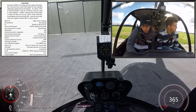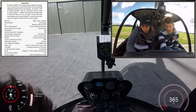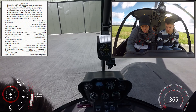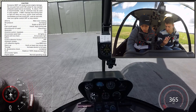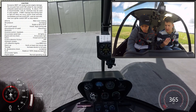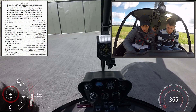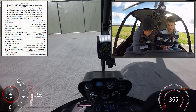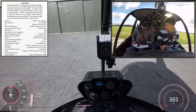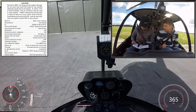It's looking like it's going to start — we've got 40 seconds. Once it reaches 60%, that's self-sustaining, so you can take your hand off the fuel and put the guard on it. And that's it — that's the most dangerous part of the start. Now let's go through the rest of it.